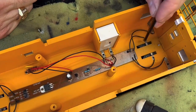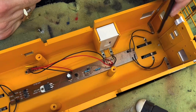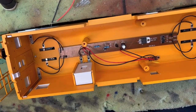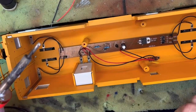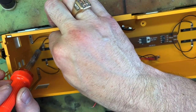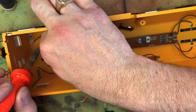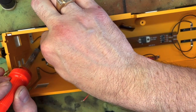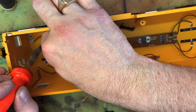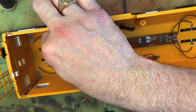Here is where your power comes from — there are little solder joints right there. All I'm going to do is solder in a whip that a nine volt battery can plug into. You can either pre-load the end of your solder tip with some solder and drip it into place, or just heat up the solder that's already there to get your wire to stick. I'll add a little melted solder on the tip and let it drip right onto there, and we have good contact.